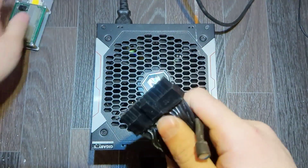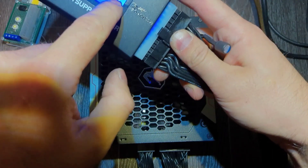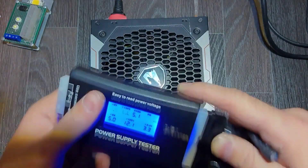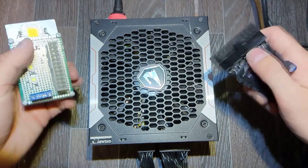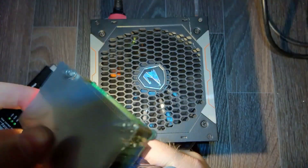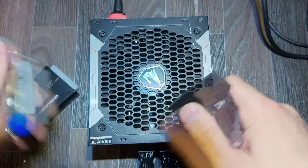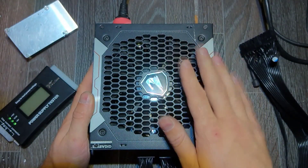It's working. Let's check with another tester - sometimes it is useful to test with this because here we can see the power good signal. The minus 12 volts was showing slightly off, but I think it's because there was no actual load. Sometimes for good stabilization of voltage you should load it a little bit. Anyway, I think this one is fixed. Thanks for watching, see you next time, bye bye.